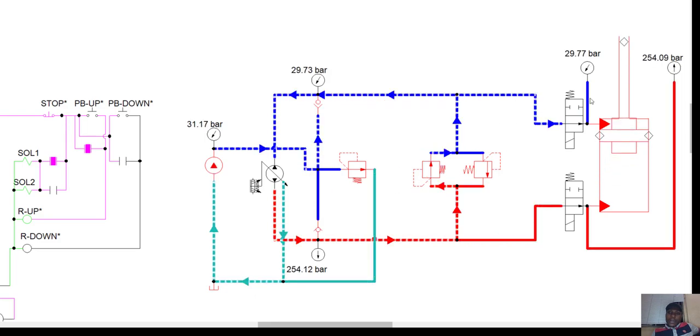The maximum set point is 250 bar as a result of the reference set point pressure at this pressure reducing valve — it also acts as a pressure limiting valve. Any excess pressure will be bypassed and go back to our source. Without this on the line, our pump might overwork and continue to generate more pressure because of the swash plate deflection being at full force. The electrical command is responsible for moving our valves and works on both the pump and the cylinder to make sure both sides are controlled at once.